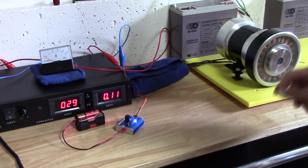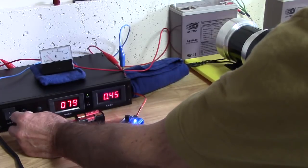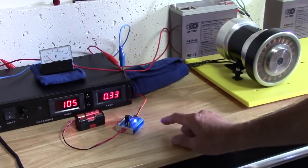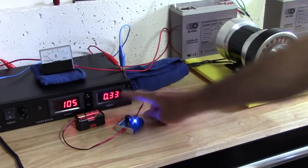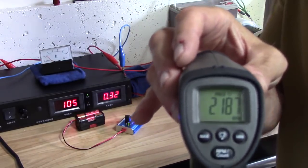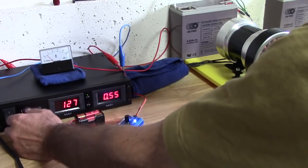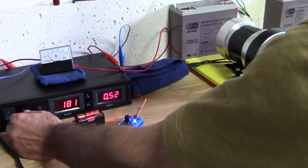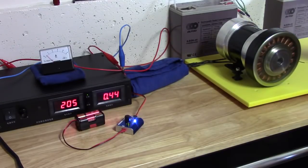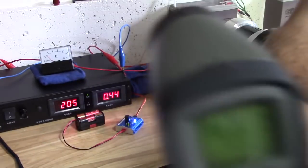But those hyperdrive motors require a lot of volts instead of using a lot of amps. Now I'm going to crank the volt here. Now you kick in the second gear. That's 100 volt put in, and that's what I'm drawing. And the RPM right now, if you can see that, is 2000 RPM. Okay, zero again. Now let's see what this puppy can do. We'll bring it up to 200 volt output. Now we're spinning that baby at 4263. There we go. We'll zero that again.